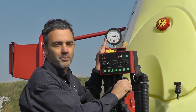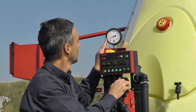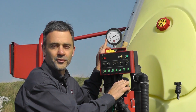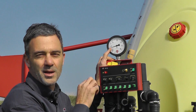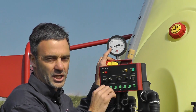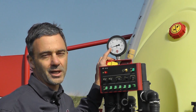Do you have problems with pressure drop when turning a boom section off? Here's a helpful hint from Hardy that may help you. Regardless of whether the pressure is on or off, it should stay the same. And if it doesn't, it means that there's an adjustment in the pressure equalisation at the control unit that's not regulated properly.